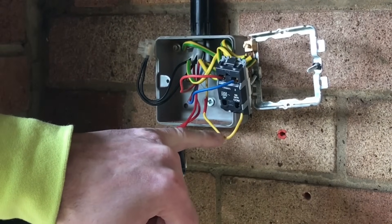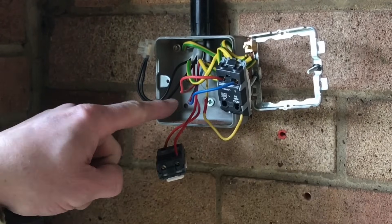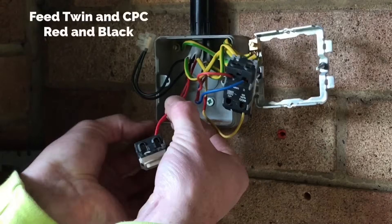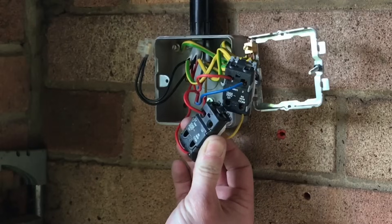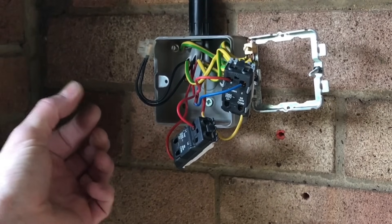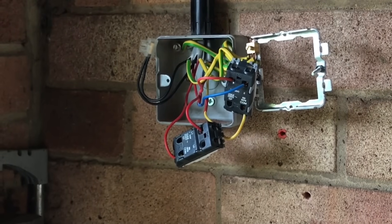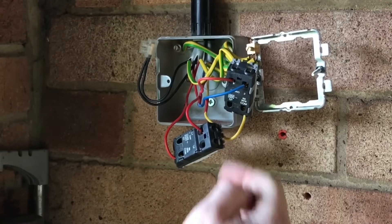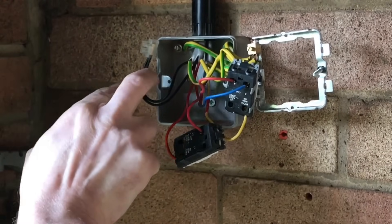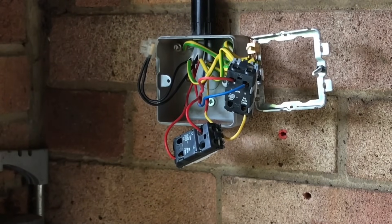The end of our three core has been connected again — we've used yellow for common at both ends, it's identified with red tape as a switching line conductor, and then L1 and L2, it doesn't matter which way around, we've got the red and the blue of the three core, and once again the blue is also identified with red tape. We've then got a supply feed coming down into this switch, bringing a permanent line into the actual switch for the outside light, and we've got the neutral coming in which is terminated into a five amp connector block. The cable going out to the outside light carries a switching line in red and the black neutral goes out to the outside light, giving it a switching line and neutral. The neutrals are connected together in a connector block — notice they're black and not blue, and these are red and not brown, so they're in colours pre-2004.